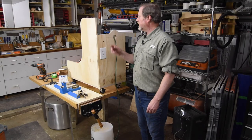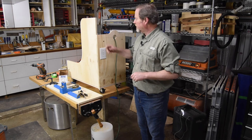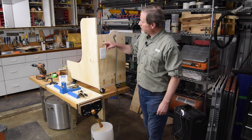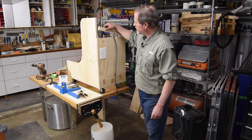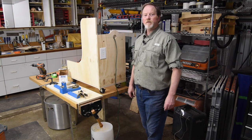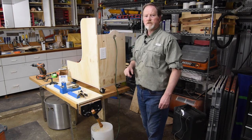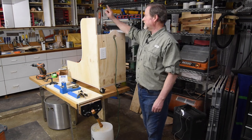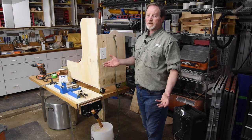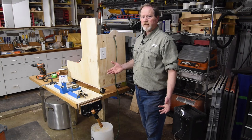Well, you can probably tell that I've achieved my ambition of getting this whole thing to go a little lower. We are much taller with my side plate than I had originally thought I would be. I think I could make the cut here at the bottom where this piece comes off, but to be truthful, I think I like it better here at the top, and it will not interfere with how this piece goes in. So I'm going to make a mark here, take it to the table saw, and trim it. I'm going to put my edge back on with the jigsaw, and then sand it smooth with the drum sander. A little extra rework, but it's going to be okay.